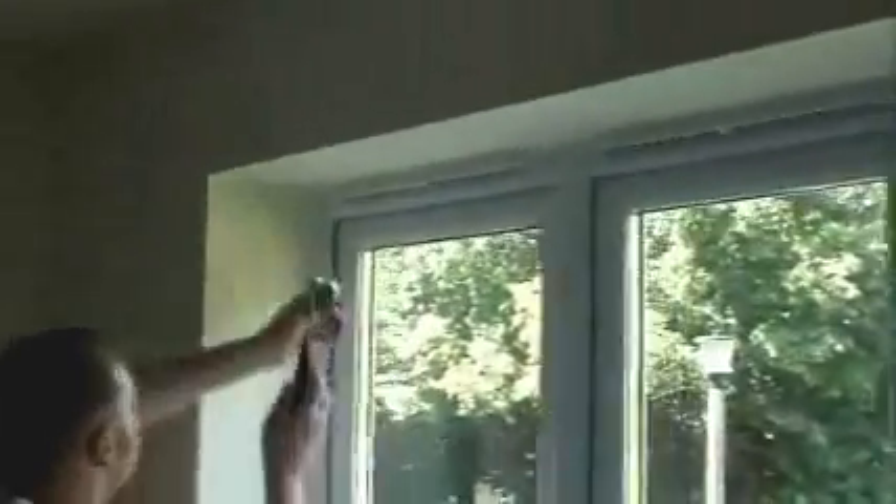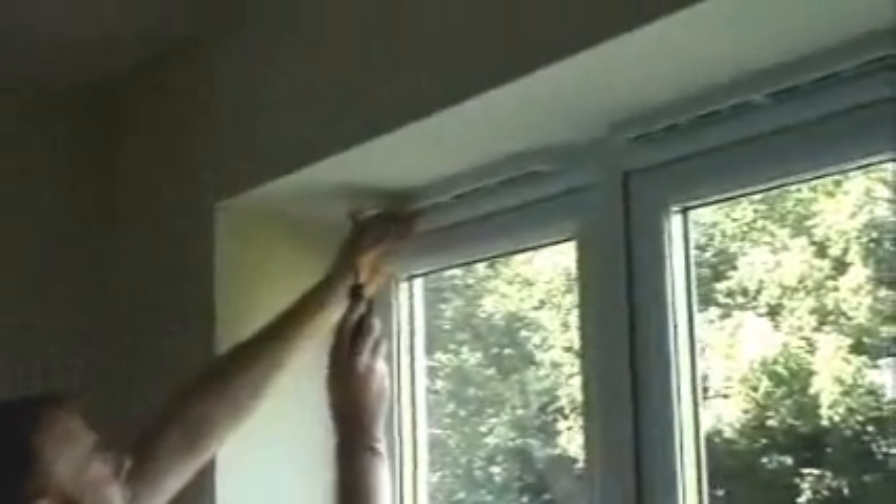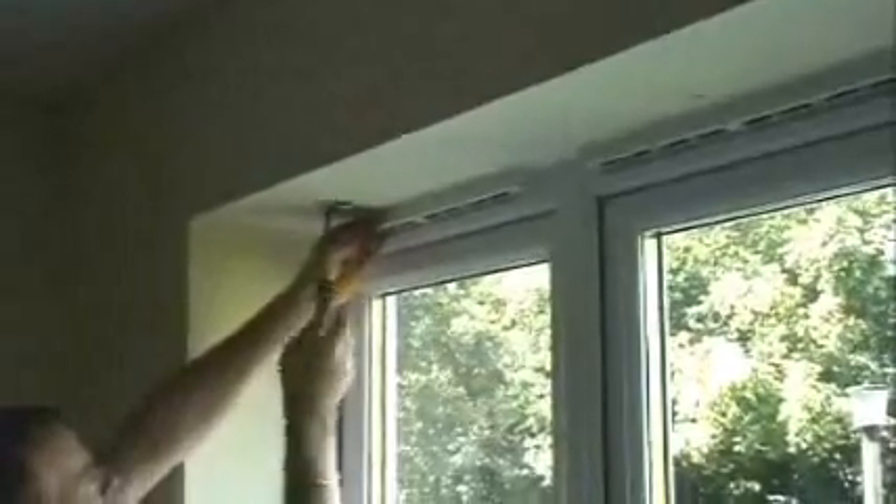We did have metal, so we're going to self-tap with inch-and-a-quarter number six screws — assuming they're long enough — to fit to the metal that's above the plaster. If it had been hollow we'd have used plugs or hollow fixings, but we actually quite like fitting into metal because it's a good strong fit.